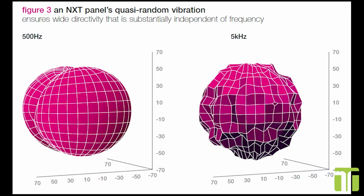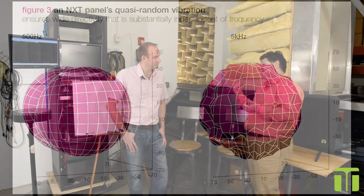Using 2.83 volts. And if you measure these, there is actually equal energy going out the back as going out the front. Which can be problematic, and we need to have ways of dealing with that. Not in every application does that work, but looking at it that way, it's no problem saying this is probably the most efficient audio device I've ever measured.